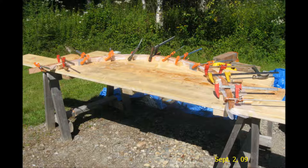So in order to do my replacement, I would only have to make one new piece for frame six aft. This shows the first of those pieces being laminated. You can see this is a much bigger frame that goes all the way across the bottom of the boat and will be scarfed into the existing upper parts of the frames on each side of the boat and then lag bolted to the keel with bronze lag bolts.